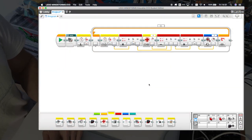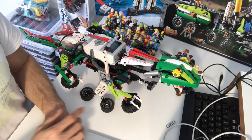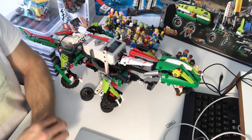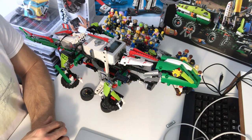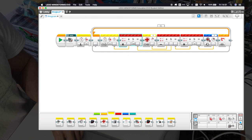I also see that the motor is running backwards, so we're going to make this negative 100. Whenever five seconds have elapsed I want the motor to be at minus 500 degrees, because this motor is mounted backwards so that the net effect is the legs moving forwards. Good — so now we do the back legs.